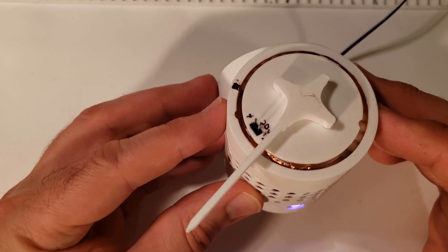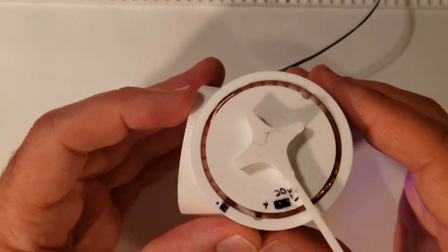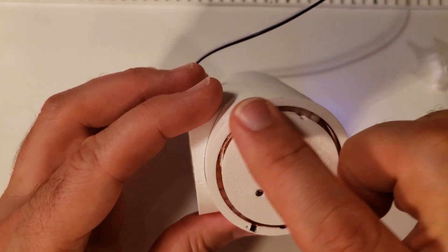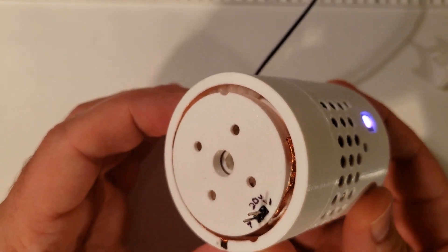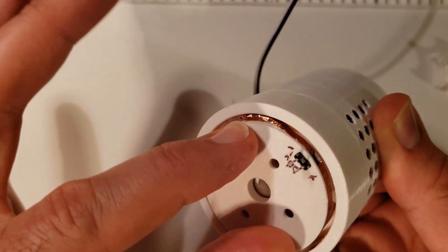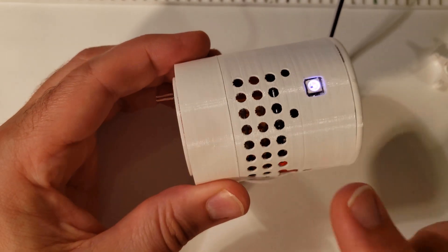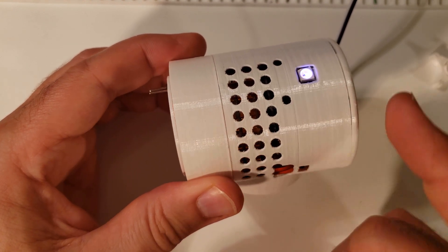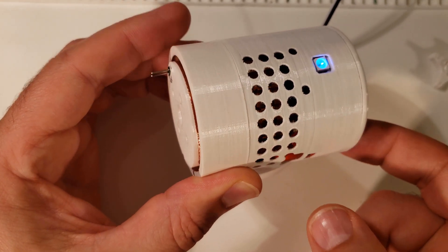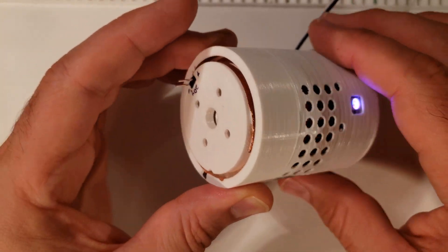The ESP32 has amazing RMT hardware that lets you send duration lengths into separate hardware to play back pulses. I've got 20 volts coming out of the slip ring — you can see the copper in there. Even when moving the actuator around, there's pretty good stability and the backlash doesn't really move. The fan will increase in speed as it heats up, progressively going up to 100% to cool it off. I've been able to keep this below about 38°C Celsius while running.